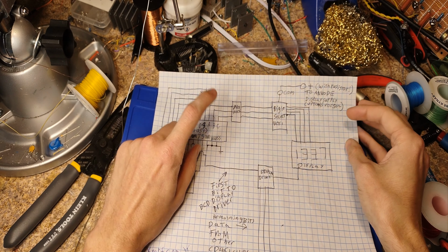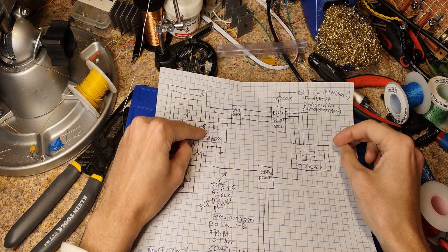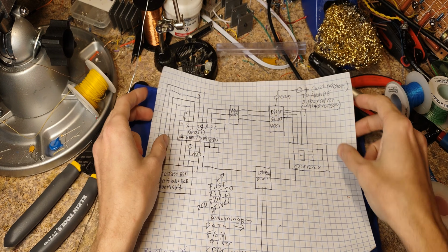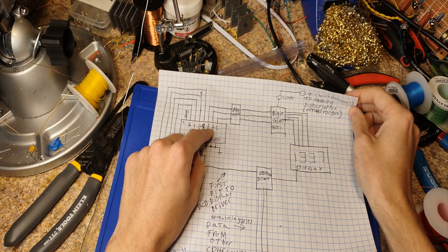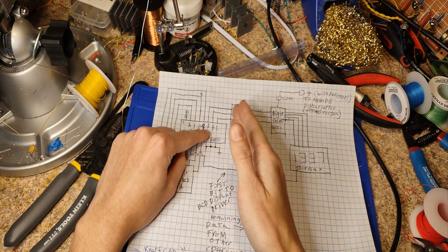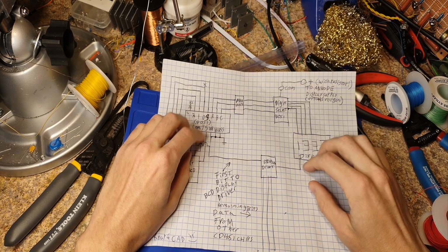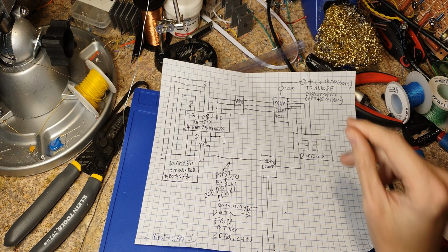That's about it. That same digit select function here is also going to be telling the output what digit that is, because otherwise it's just nonsense data if you don't have a clock to try and extrapolate that from, and even then it's a bit iffy. But that gives the display multiplexer the information it needs to find out where to put that digit on the display. And that's about it. Let's get to it. I'll come back when it's all built up.